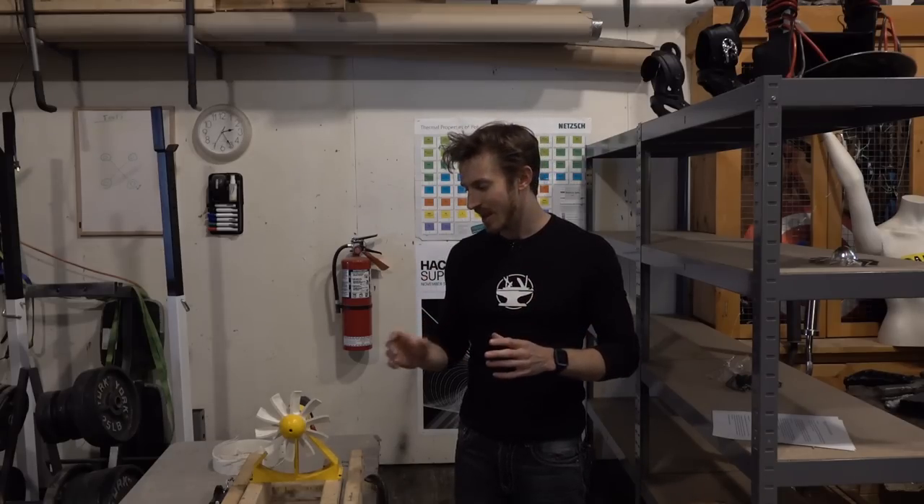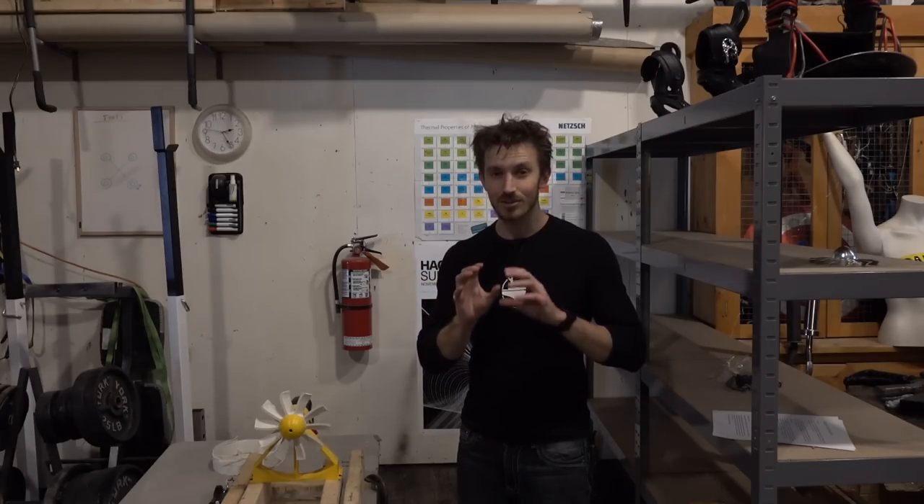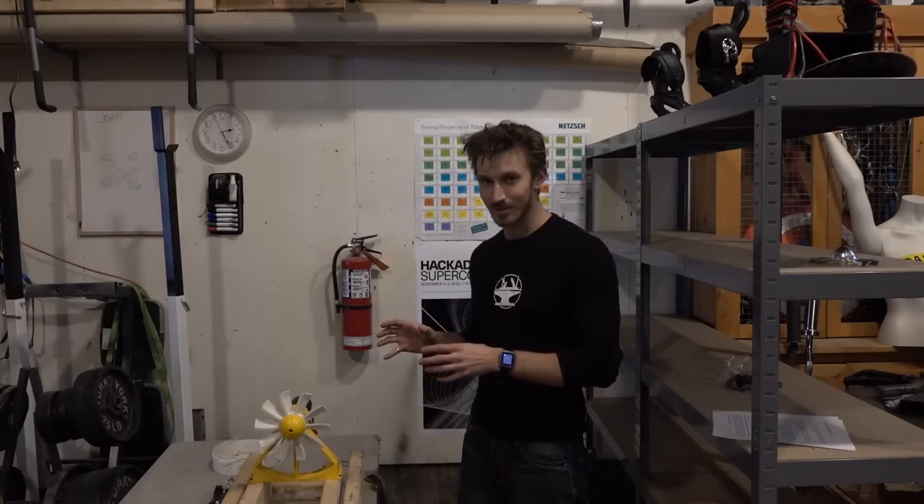While you can do at-home casting — and there are tons of DIY channels that show you exactly how to do it — the problem is it's not very accurate or precise, and for something like this it's just not going to work. At-home casting, unless you have a very expensive setup, will have imperfections like air bubbles that can cause huge weaknesses when you spin it up to 40,000 RPM. It would be way too much risk to cast a blade and actually use it. Is it possible? Probably, but it would take a lot of tries and it might just be cheaper to have them CNC machined.